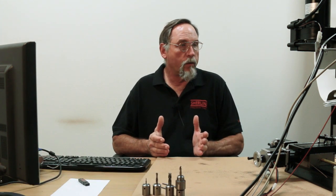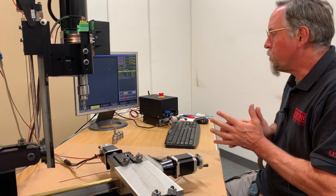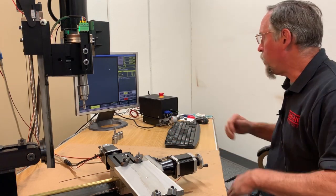Hello, I'm Carl Roland with Sherline Products. In this video, we're going to walk through setting up and running an entire part. We're going to go over getting your home position using an edge finder, how to set home positions in your controller, how to set up your tool offsets, and then we're going to step through the part one process at a time. We're going to step through the program for doing the Sherline cup holder.